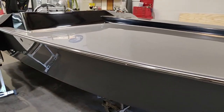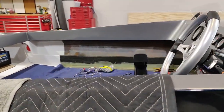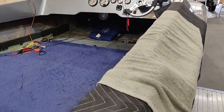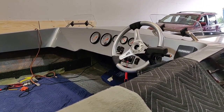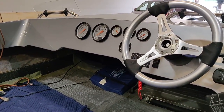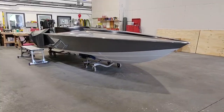As you'll notice from earlier videos, the tank fill is at about the middle of the boat and runs down to the tank, which is mounted quite far aft. It's a long narrow tank so it goes pretty far toward the middle. We have venting out back, and by having the fill in the middle while the boat sits slightly leaned back in the water, it should fill better without any air lock or airflow problems.